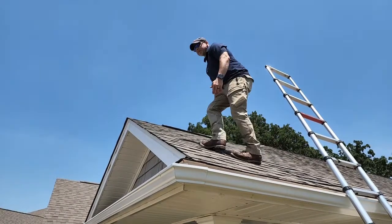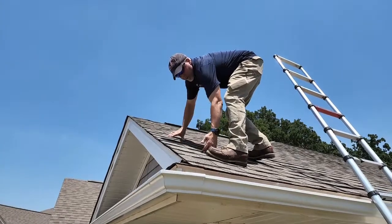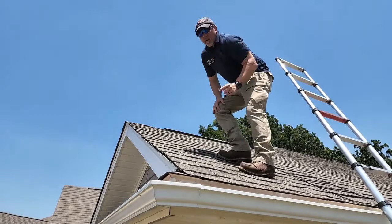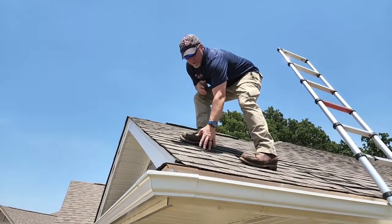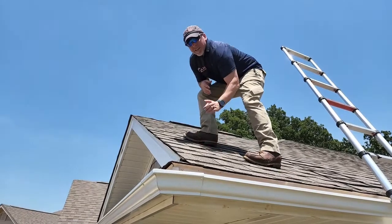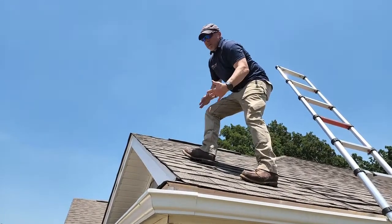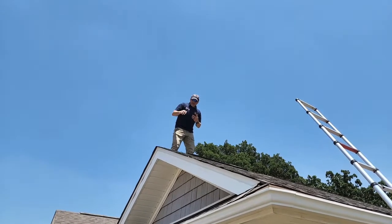The other thing we're looking at — right here under the edge — is a little line of tar. The tar holds the shingle down to the next roofing shingle. But we don't want to see any nails below this line, otherwise we create a place where we're going to have a leak later. You can't see it from down there, but I can see it from up here.